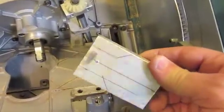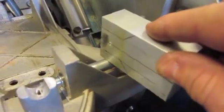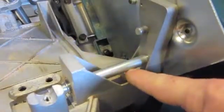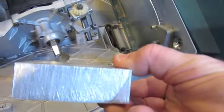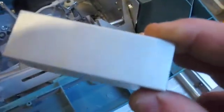I've had to draw some lines on it because that's going to allow clearance when I chop those parts out. I have to drill where I've center punched the diameter of this rod, and that will allow it room to move a little bit. And then I also need to go in through the end here, and that's where I'll run the threaded rod through. I'm going to try to thread it.